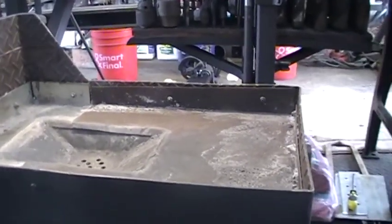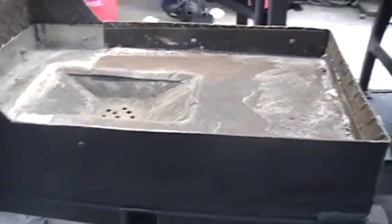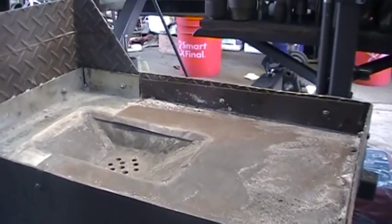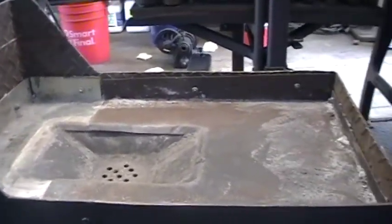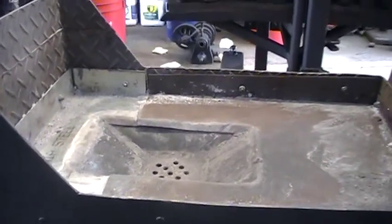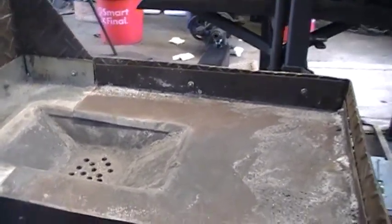So in 2000, which was over 20 years later, I rebuilt this thing again and cut it all the way down to this. You can see I welded it back together, so it was only about an inch and a half here. But it was still your basic rivet forge, and you can heat up half inch round bar and stuff like that, but the firebox wasn't there, it was flat, and it just wouldn't work. I mean, it does work, but you're fighting it all the time.